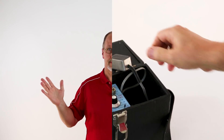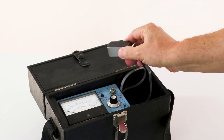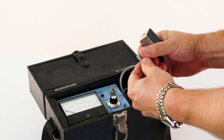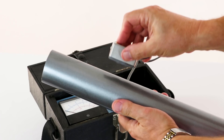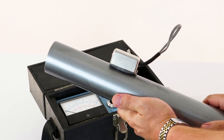Now, depending on the manufacture of the clamp-on ultrasonic flow meter, there are many different types of acoustic couplant. They are also commonly referred to as sonic grease. In fact, in the old days, we didn't even use a grease. If we turn back the clock to the late 1970s, when I used this old analog display Doppler flow meter mounted in an even older camera case, we used modeling clay as a couplant. Needless to say, clay was not an optimum sonic coupling compound and was soon replaced by more practical grease products.